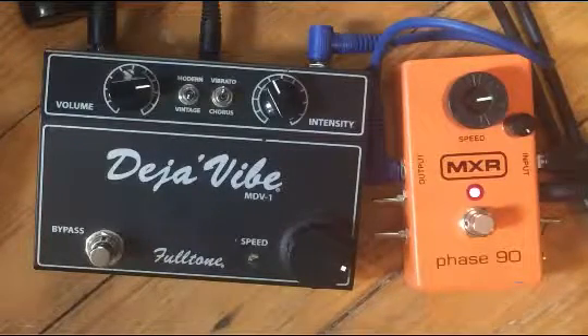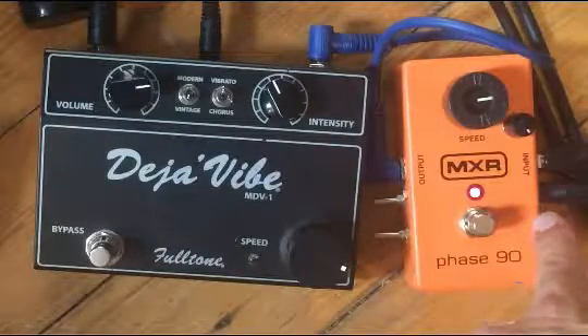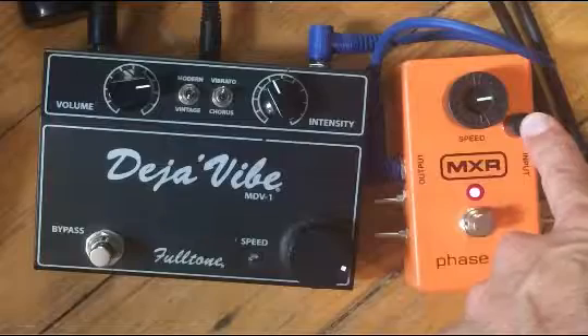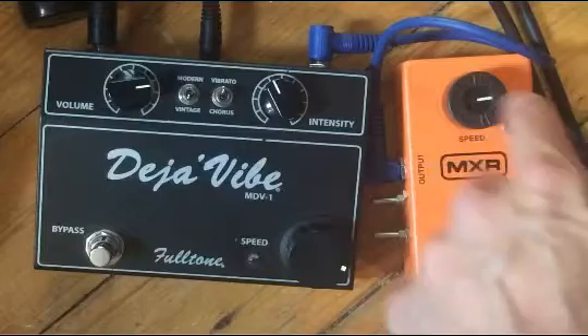What we've got here is four mods. We've got the script mod, which involves taking out R28 — the feedback resistor. This is the death knob: a one meg pot instead of a one meg resistor going into the trim pot that's right around here.